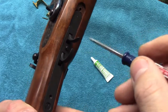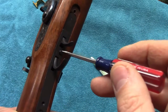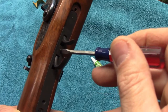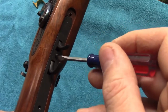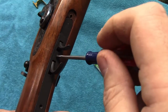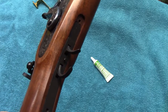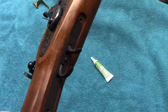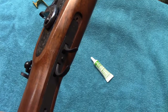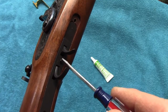As quick as that kicks forward, you stop immediately. Don't go further. From this point, Thompson Center recommends to back that little screw off one full turn. Just look where the little screw is oriented — there's a half turn, there's one full turn. I personally back them off a half turn, but I shoot a lot of bench rest target and I'm very comfortable with these triggers. Thompson Center recommends to come off one full turn.